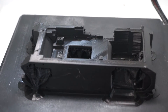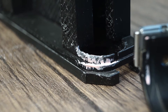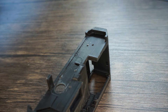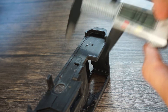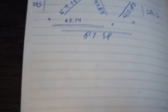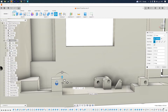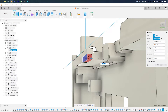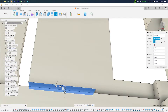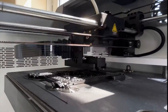I printed out the first print of this new version and tested out my new microphone. Then I had to use some nail polish to find out why the front cover did not fit without filing down the sides of the chassis. I started noticing that each time I measured the chassis it would appear to change size. I love any excuse for new tools, so I used calipers to get everything lined up that I was struggling with earlier, and made a quick test print to check the front cover mounting is lined up. Going back into Fusion 360, the motherboard could have been raised a little more, and because of that the battery cage also had to follow along, which meant moving the cutout on the back where the battery cage rests. I had to adjust this individually on each edge by 0.8mm.